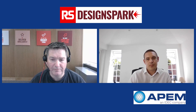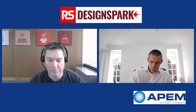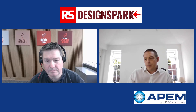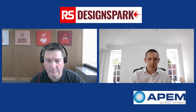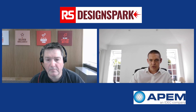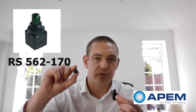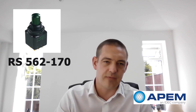In terms of environmental performance and mechanical conditions, what makes these switches stand out is really focusing on the harsh environment. They are fully sealed IP65 all the way through to IP69 depending on variants. They withstand shock and vibration, salt spray, and humidity — they're really designed to work in any environment. APEM sealing boots also stop any further dirt or water ingress entering through the bush, and prevent freezing in really cold temperatures.